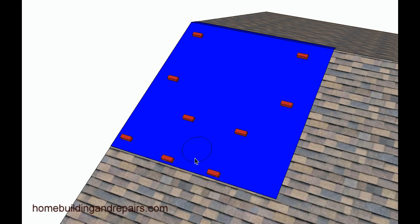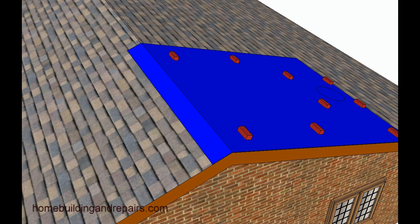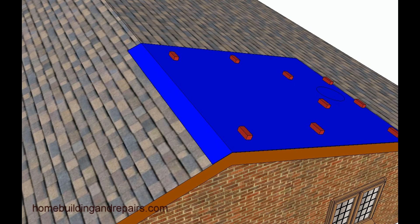Or you could have a hole in your roof that is in another spot. It's leaking here, and it's not uncommon to have a leak in one area but actually the hole is over here somewhere. So you might need to cover a larger area with a tarp. I've actually seen people cover their entire roof because they can't find where it's leaking.